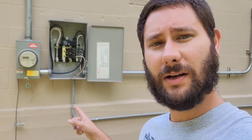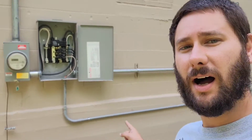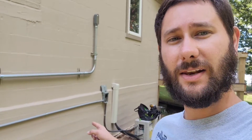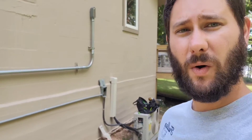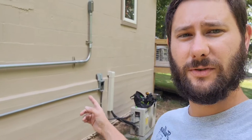You're watching HVAC Tips for Technicians. I'm Tad, let's get started. Today I'm replacing the conduit and the wiring inside of the conduit that comes from that electrical box and goes to my non-fused disconnect. I'll also be replacing the wiring inside of the whip or the flexible conduit that leads from that 60 amp non-fused disconnect to my outdoor unit or my mini split.